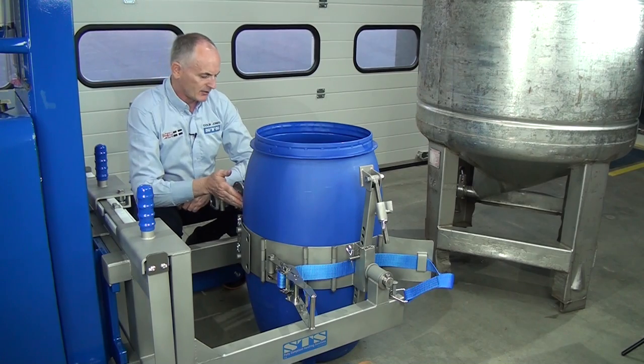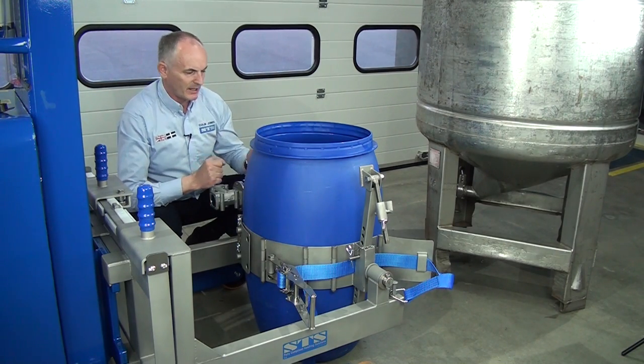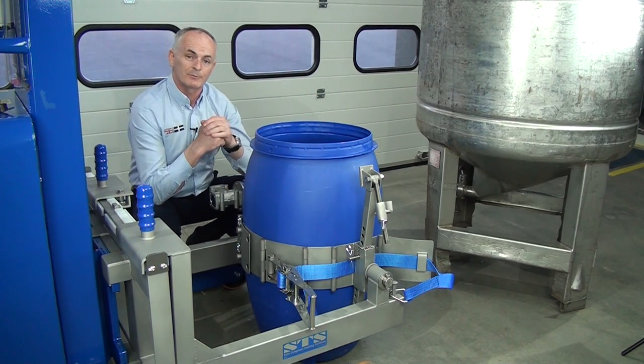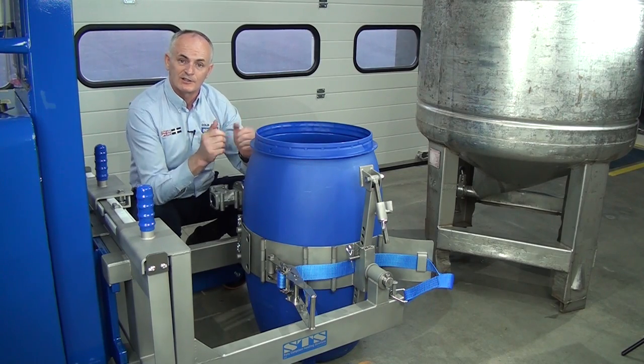that's a nice angle. It's nicely touching the drum all the way around. And the pivot is right in the middle of the gearbox. You can see the pivot on the other side is right in the middle of the drum. And that shows you in the correct position for this. So what I'll do now, I'll come around the other side and we'll tension it up.